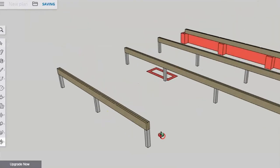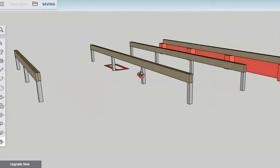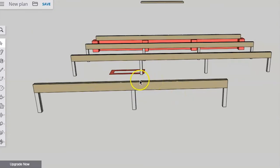So that's a basic rundown of installing bearers. They're not very difficult really — it's just cutting a big piece of timber and sticking it on the posts. But there are a few things you have to be careful of: checkouts and holes, keeping them straight, and also whether or not they are continuous span or single span, which hopefully you have already covered in a previous video.